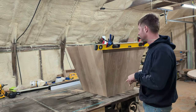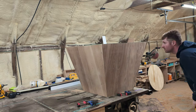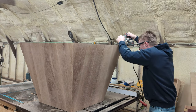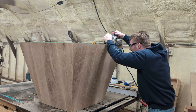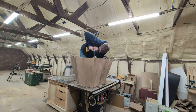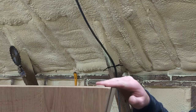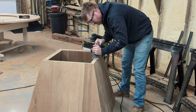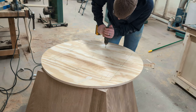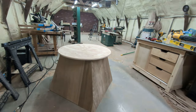Before attaching the top to the base, I got my laser and straight edge out and traced the laser line all the way around the underside of the table to ensure everything is flush and level. Then I grabbed my planer and planed down to that laser line all the way around the bottom side. Since the base was upside down, I added the threaded leg levelers — a simple process that makes every piece of furniture a little bit better. Flipping the base over, I gave the top the same treatment as the bottom, then attached the round piece of plywood by drawing layout lines, pre-drilling holes, and countersinking Torx screws into the base.